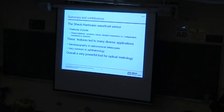And the other thing is you can actually calibrate it, and I've done this and gone out to the edges and tried to see if there was any variation in it. It's really small, mostly because I'm picking such a small lenslet. I'm really going over a very small angle. If you went to large angles, you would probably have that problem. But that turns out to be just fine clear to the edges of the dynamic range, before the spots start running into each other or they're outside of the range I'm looking for.